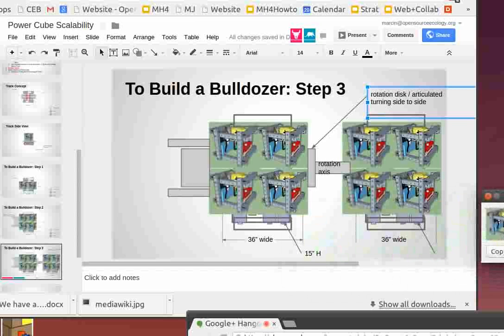Like in a bulldozer operation, you typically go straight forward. Upon turning, you'll basically bend the machine. Therefore, if you're doing anything that requires all forward motion, the two sections have to be aligned by all means. Otherwise, you will potentially break stuff, because you put a lot of force on the rotation axis instead of transferring it to whatever you have on the front. So the operator would just have to be aware of that.